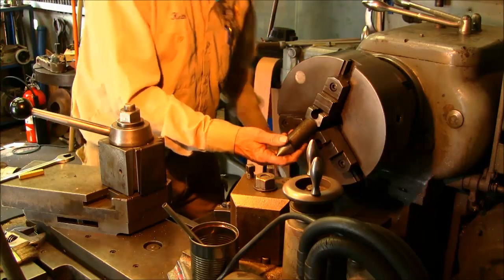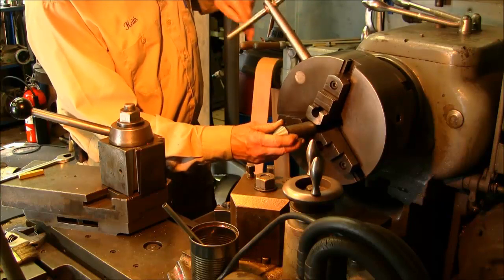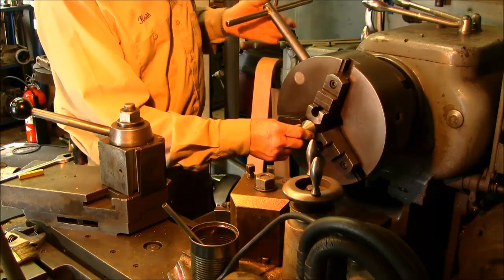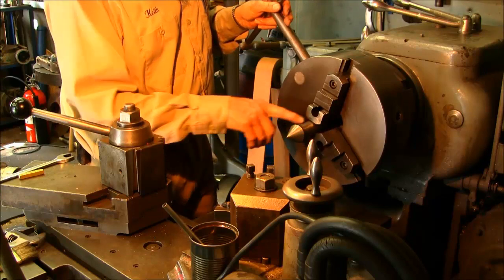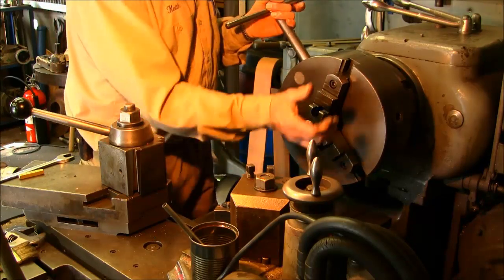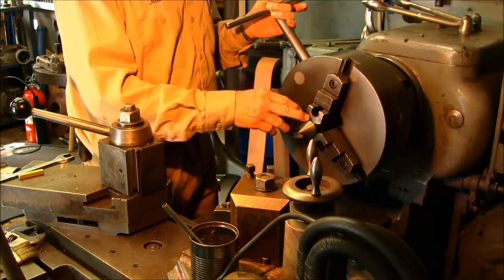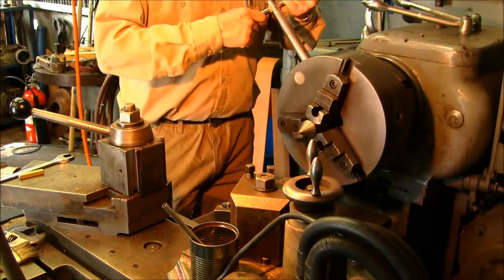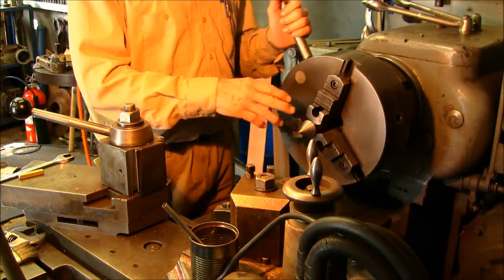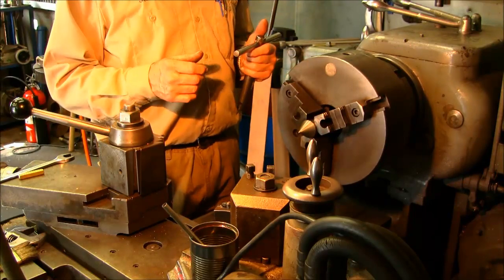And that's what you do to make it run 100% true: take a machine cut on your center or your angle. I usually turn the diameter and then turn a little shoulder so that the pressure, the friction of push on this, is supported by the front end of your jaws, and you don't have to over tighten or have anything loosen up on your compression of running between centers.